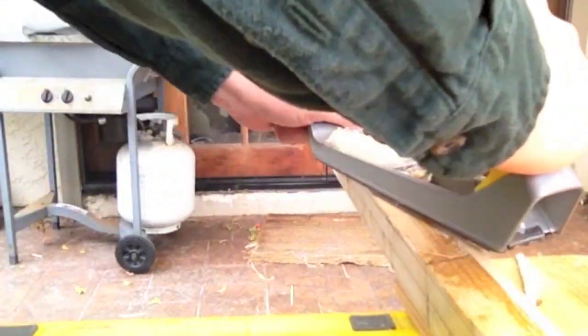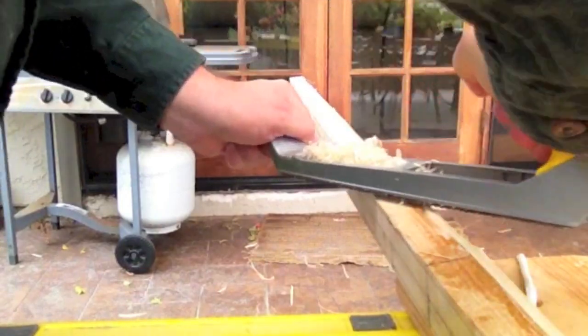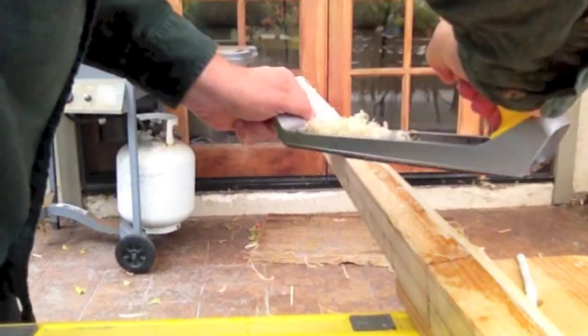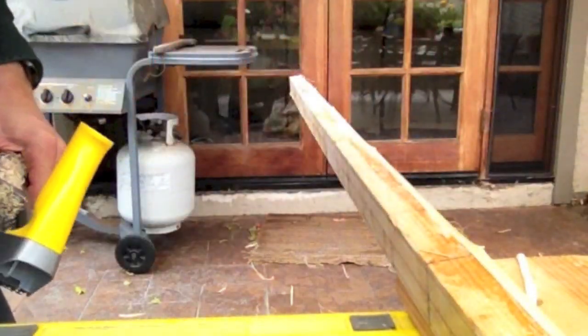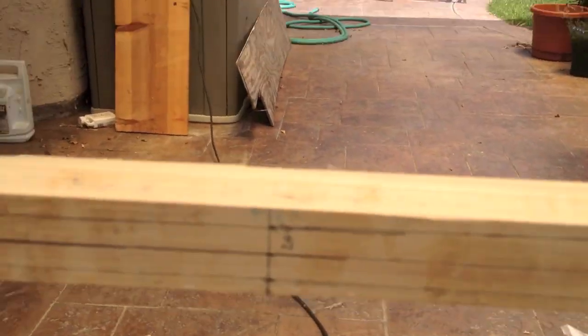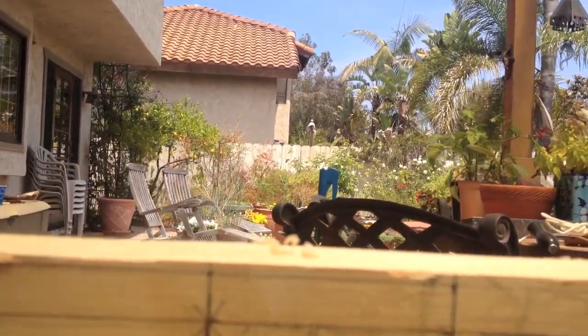It actually takes a fair amount of time to do this. When I get done, it looks like this — you can see I've laid out the belly of the bow. It's laying on its side now, and I'm going to start thinning down the wood with the draw knife. You can see the lines I've made; I'm going to thin down to about a sixteenth of an inch of my guidelines with the draw knife.